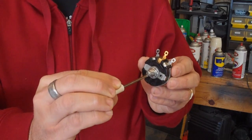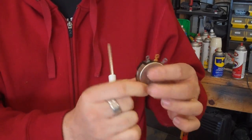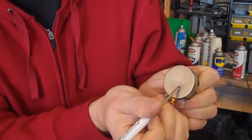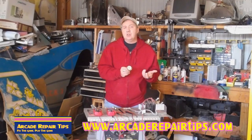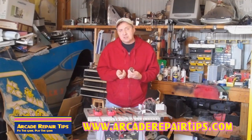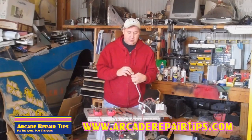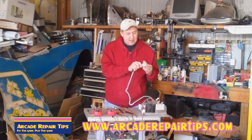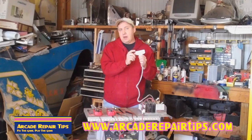What is neat about this type is it tells you the value of the pot on the back. Some of them do, some of them don't, or maybe the package you bought it in might say. So a good thing to know is what size it is. For volume, for instance, if your game doesn't turn up very loud, you could change up to a higher pot value and allow more or less resistance to flow. Another very useful type is these potentiometers off of a chassis auxiliary board — a lot of times they will be mounted onto the chassis.